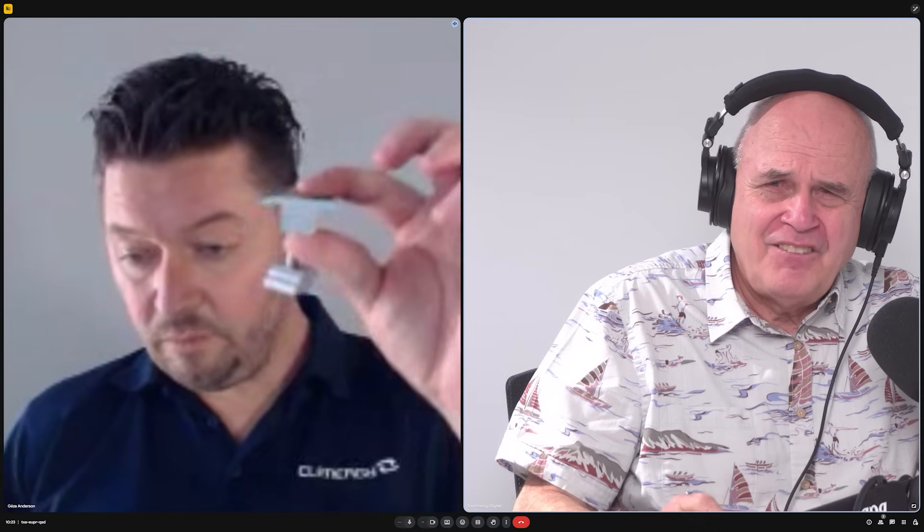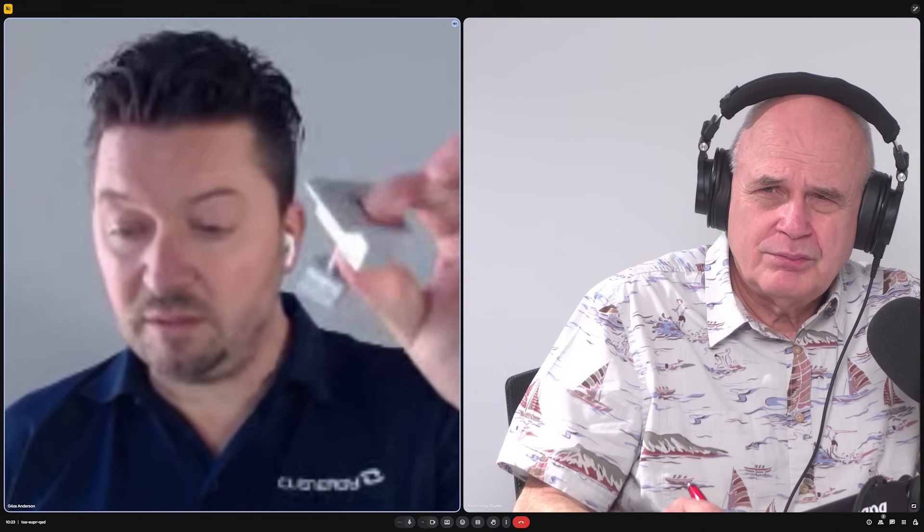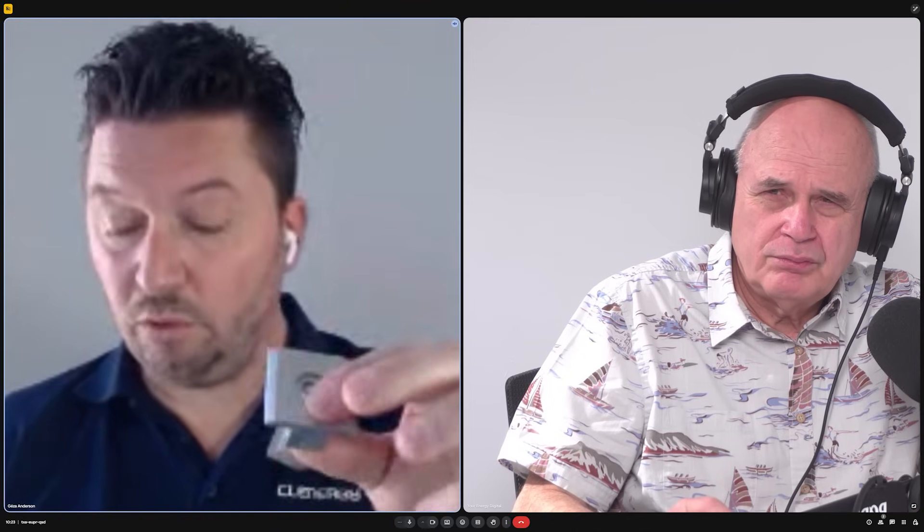So anybody out there using Clenergy — when it comes to the gear, you've got the fastest engine and the Ferrari in your stable currently with this setup for the tin roof installation. I can confidently say this is the fastest system you can get. Are there any other surprises in the Clenergy stable? Well, apart from this clamp which comes in 30 and 35 millimetre and also in silver and black, some installers need a universal format suitable for multiple panel heights.